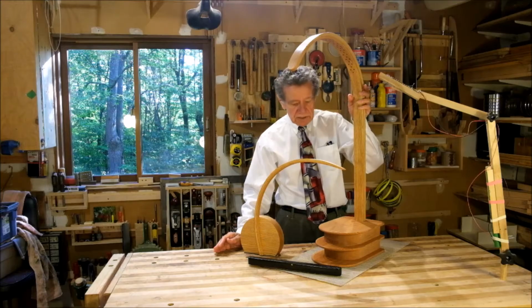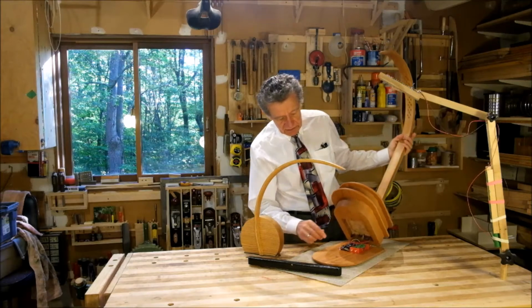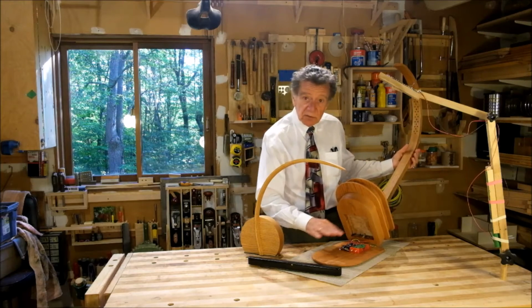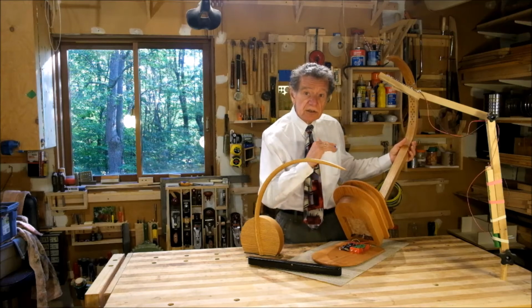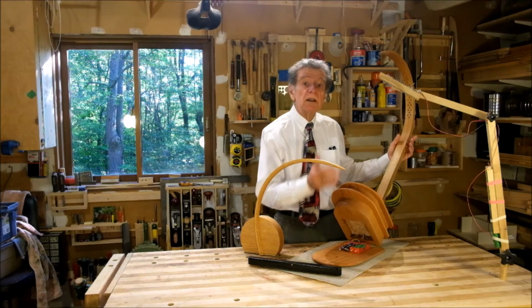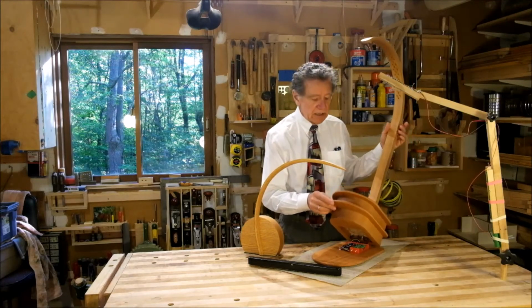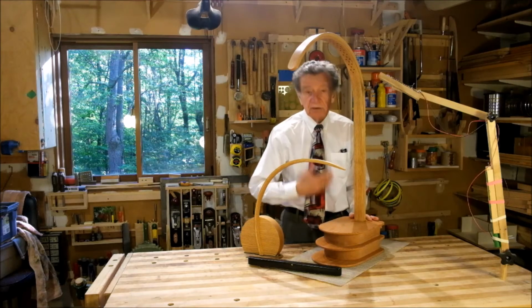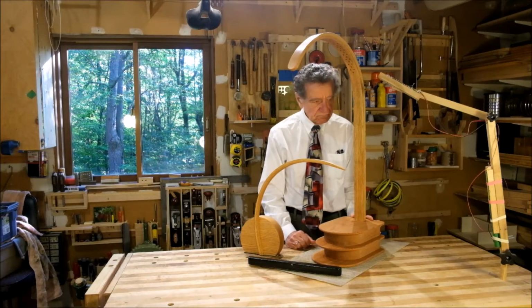One thing to watch out for is in using LiPo batteries in series. It's possible with this simple circuit that one battery will discharge way too low while the other one continues to work. So I'm going to modify the circuitry in time so that that's not allowed to happen, because otherwise you'll lose one of the LiPos every so often.